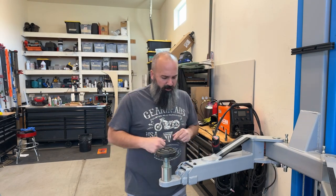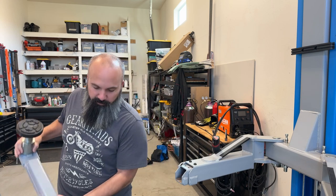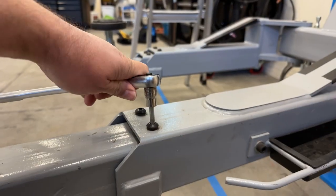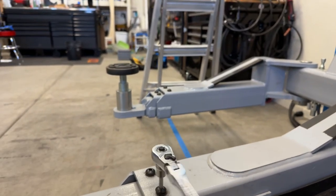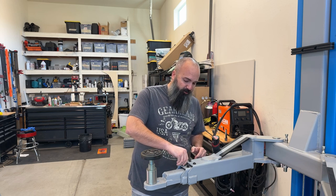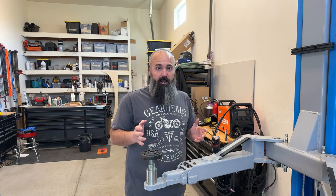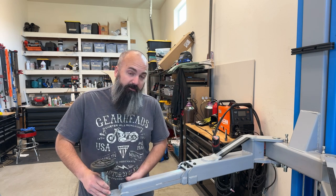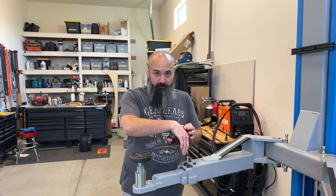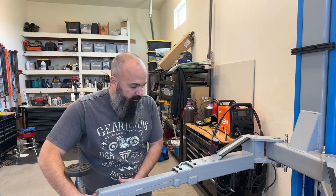Aside from the lift cables, the rest of this is pretty quick. What are we checking on the lift arms? If you go to pull one of these arms out, you really don't want it slipping off. So we're checking to make sure that the retaining bolts are tight and haven't backed out. It would be a pretty sad day if you were trying to pull these out under a car and something horrible happened — the car in the air, the arms slip and don't get caught. These are just a good safety measure so the arm won't pop out unexpectedly.